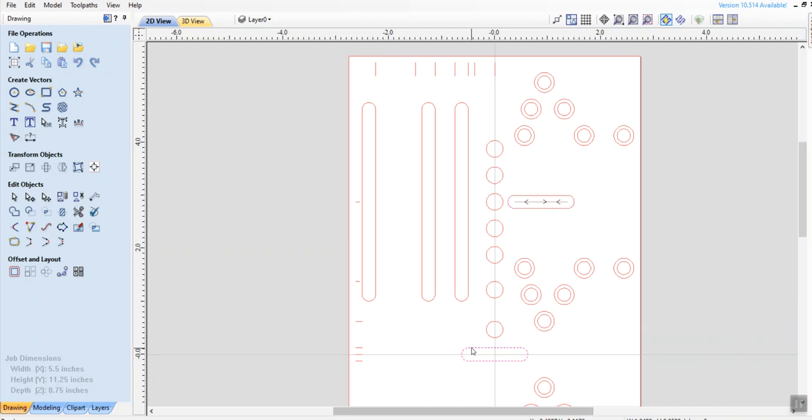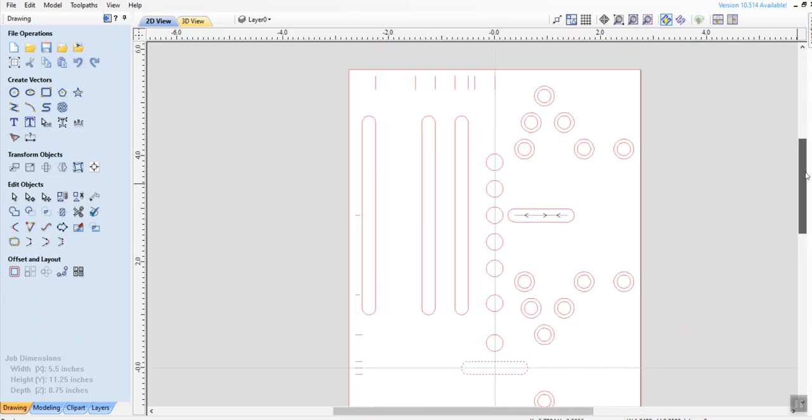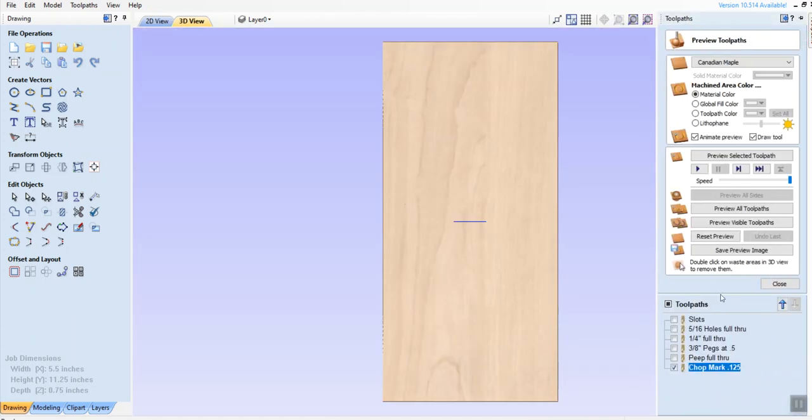This last one here: I'm going to stick an 11 and a quarter inch board into this machine, but I only want five and a half inches of it. So where do I cut that? This little mark tells me exactly where to cut it. But this one I only take to 0.125 — it's just deep enough to make the mark and allow the tooth of my chop saw to fit into it. If you look at some of my other videos, you'll see how I chop that by putting the tooth up against the left side and cutting it, then flipping it. It basically eliminates this center quarter inch entirely and you end up with a perfect 5.5 by 5.5. I call this 'chop mark' at 0.125. Calculate.